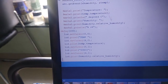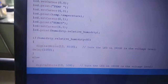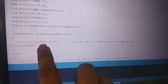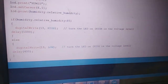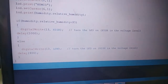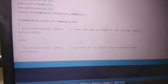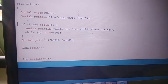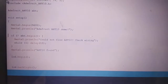I set the cursor to the sixth position and print the humidity value. Then there is a small if-else loop: if relative humidity is less than 85%, it switches on the relay using digitalWrite(13, HIGH). digitalWrite(13, LOW) switches off the relay. If HIGH, there is a 1-second delay to prevent rapid on/off switching; if LOW, there is a 400-millisecond delay.